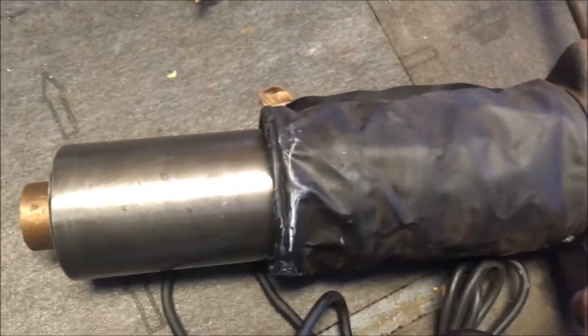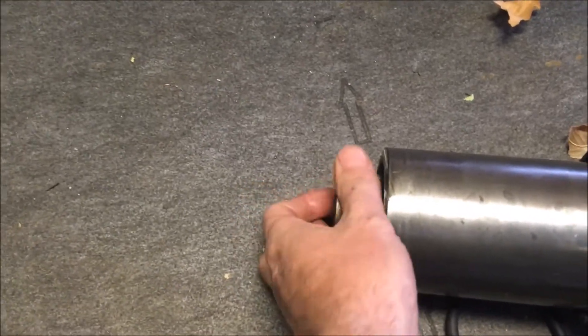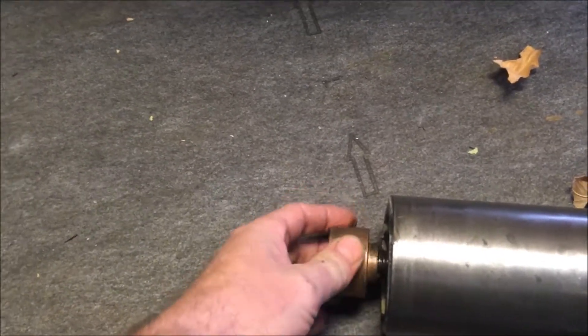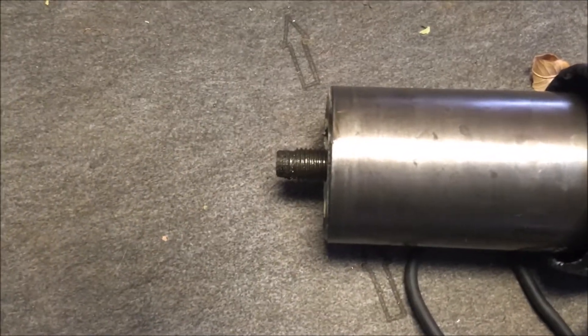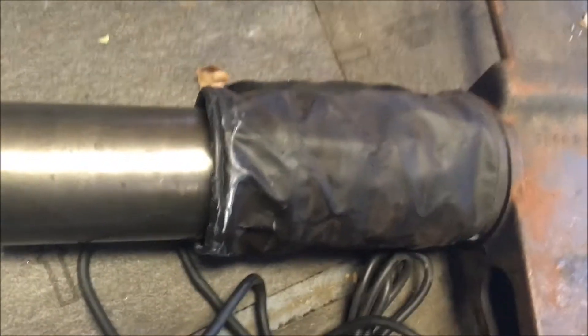We're going to do a little checking and make sure there's nothing wrong with this — pop it into another machine and see if it slides. I had to put a nut on the end of the shaft just so I could put enough screw force on it to push the cross feed out. I probably had near a thousand pounds of screw force on it. I had two 3/8 bolts tightened down with a wrench putting pressure on it, then pounded on it with a copper hammer, twisting it back and forth for three hours to get it out.